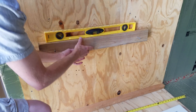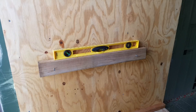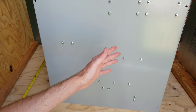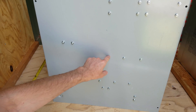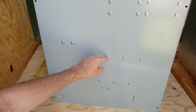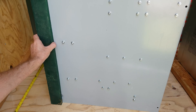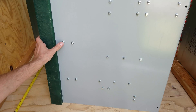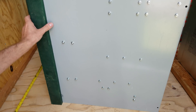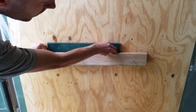I want to make sure it's nice and level. I know it doesn't look level on camera but that's because of the angle of the camera. When I go to install this panel you have to keep in mind that there are protrusions everywhere where we put bolts, so this panel is not going to sit flush against the wall. I'm going to take a bit of — I don't know if it's 1x3 or 1x2 — and just line the sides of the panel on all four sides. That should provide a solid mounting point and give me the lift I need to keep these screws from bottoming out against the plywood.